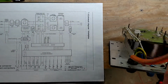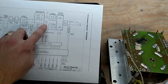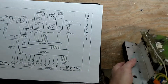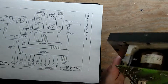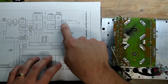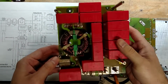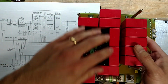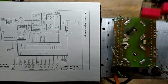And then there's none on the inside. And then these transformers are right here, they're potted. You can see there's one on each side. Alright, so I got all of that. Output filter is this board. So this is your main output filter, and then this is all bulk capacitance for going out through this fuse to your battery pack.